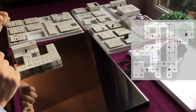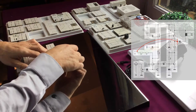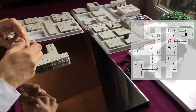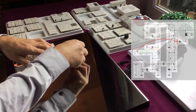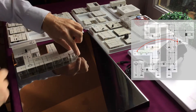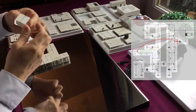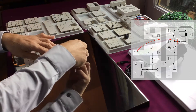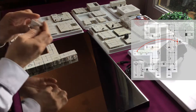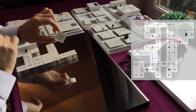Now we need a voltage divider here, so we are going to use some wiring first. We use a T-block here followed by a straight line plug. Current can now flow through our transistor. This T-block is just a straight wire between these connections. Now we have to use a resistor for our voltage divider — we use a 220 ohm resistor, and this is the way it is connected.